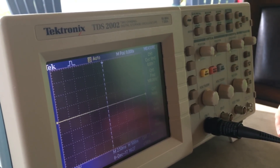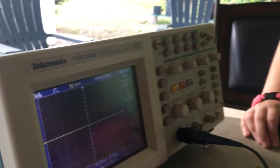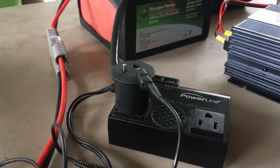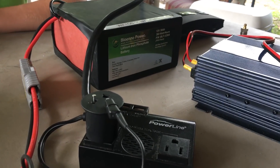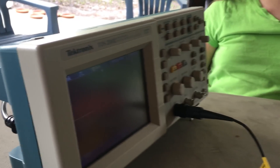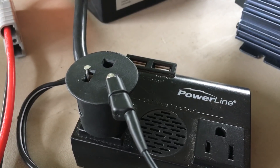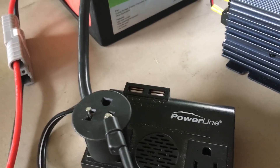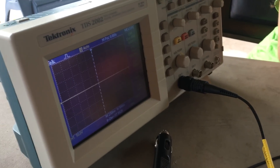So Grace, what we're going to do is use our Tektronix oscilloscope and look at the waveform coming out of the inverter. We're not going to blow up the oscilloscope because the oscilloscope is plugged into the wall while the inverter is plugged into the battery. So we're not going to get a ground loop and get the smoke out of here. We're going to tap this with some little nails that are plugged in, touch it with the probe, and then go over and see what the waveform looks like.